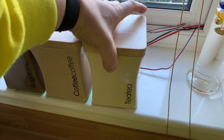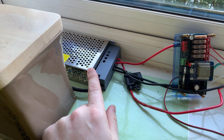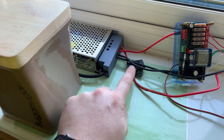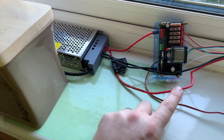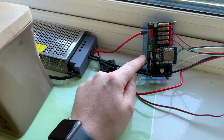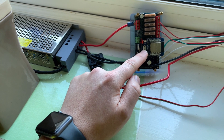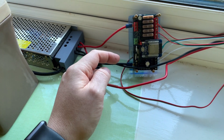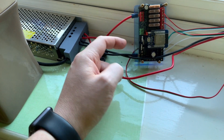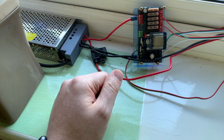In the kitchen window behind the tea and coffee urns are some wires and a 5-volt 150-watt power supply — so that's 30 amps. That's fused and that power goes out to the Christmas tree string and also into this DIG quad controller board with the ESP32 on board. Each of the strings is fused as well and this can control up to four different outputs. It's a quite neat little board — can handle quite a lot of current and has some options for expansion as well.